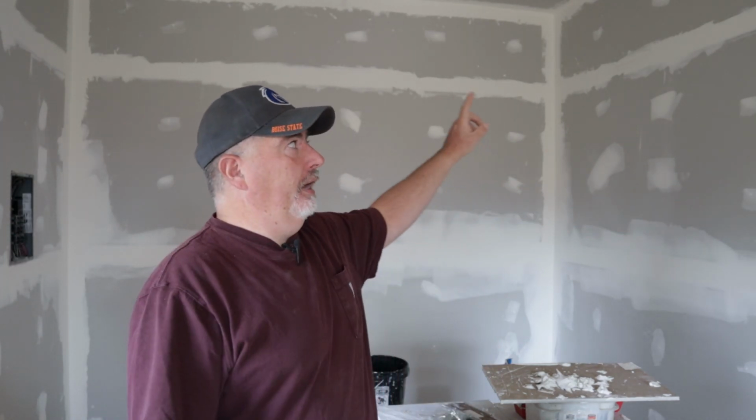The one thing I did different in here than I had originally planned was the Cat 6 wiring. Originally, I just planned on a couple drops. Well, I just went with about a 1,000-foot roll of it and put 3 drops over here, 3 drops on this wall, 2 drops in that room back there, and 2 drops in the old tack room, and brought it all behind where my desk is going to be, tied into a switch there. I figure it's a lot easier to do it while all the sheetrock and drywall's off the wall and just be done with it.